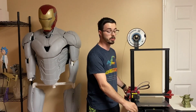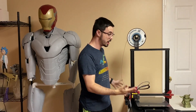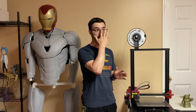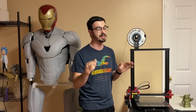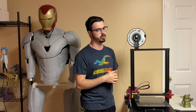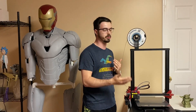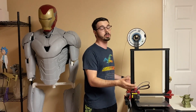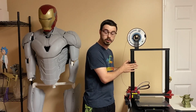I'm not going to rave about how I love the fact that the motherboard still works — that's supposed to happen — but I have put this guy through a lot of work. Nothing has gotten loose. Nothing has really broken down. Everything has been stable and perfect. The auto bed leveling is nice. Now, if you're in the 3D printing world, understand that auto bed leveling just compensates for the minor differences your bed has — you still have to level it manually and make sure it's really level. That's very, very important in 3D printing. Also a reminder: you probably should level your bed — you probably haven't done it in a while if you're watching this. You're welcome. I do it about every two to three weeks, or once a month, depending on what you do with your printer. None of the springs are broken, none of the knobs have broken. My nozzle has been great — I switched out to the 0.6mm and I've been sticking with that. It's made out of durable stuff and I love it.